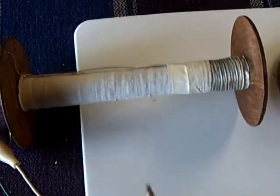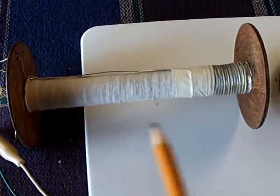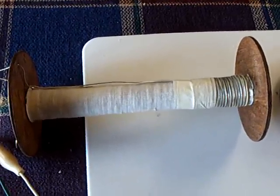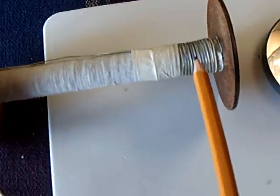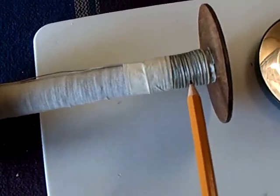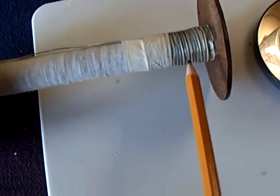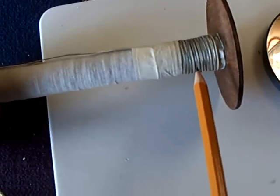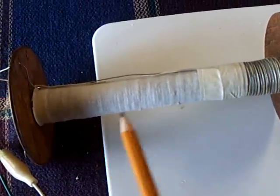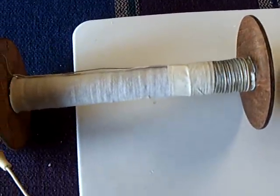This isn't the same coil. That coil I showed in my last video died, and it died within 24 hours — it died pretty fast. The galvanized coating on the wire deteriorates through galvanic action. It became just iron or steel against a wet surface with copper, became a nice battery, created rust, and killed that coil.